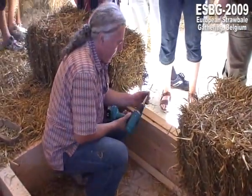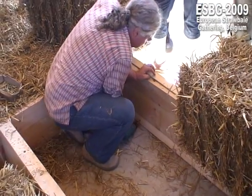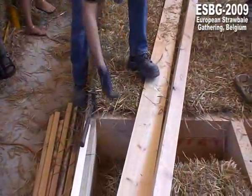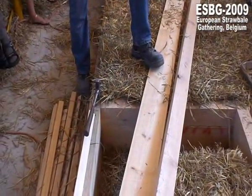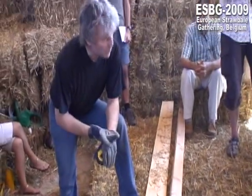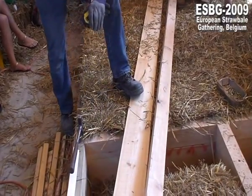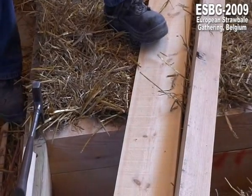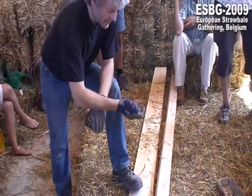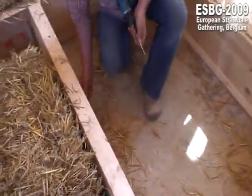And another interesting thing is we produced the beams in a way that the straw comes up a bit. So if you put on the beams the bamboo or the reed, so that the plaster has a good fixing on the wood, it's one surface, and doesn't come out. And we prefer to use wood fiber board on it, 2 centimeters thickness, inside and outside, and then the wooden beam is 2 centimeters from that surface.